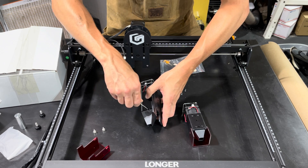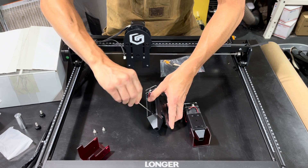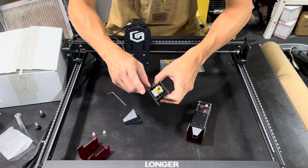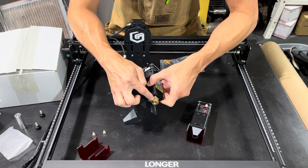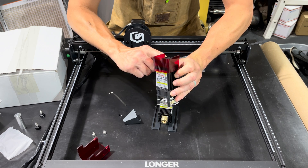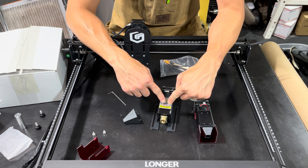Next, we're going to take the Laser Shroud off from around this, because this is where we'll need to install our new Air Assist. Here is your focusing lens — if you ever need to clean it, this is where it is. You'll notice there's a brass insert here. The inside of this brass insert has threads on it, and that's where we're actually going to screw on our Air Assist. If you've ever taken the 5W shroud off, there are no threads on it, so it is impossible to mount an Air Assist. Ones that just bolt right on — the 10W and above — work.